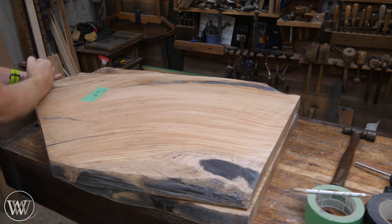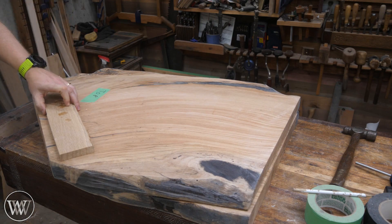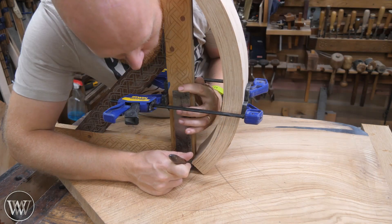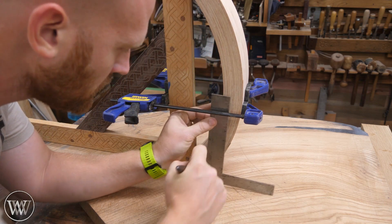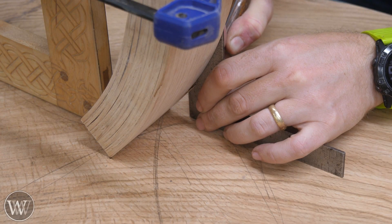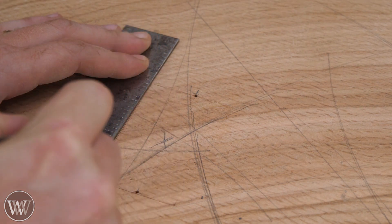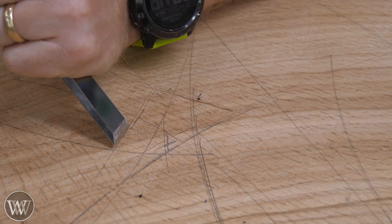We can come in and pound them down — putting a block on there and hitting them down will drive them in really nicely. Then we can pull out the nails and we have spots on the boards that match identically from top to bottom. Next I want to bring in one of the arches and clamp it up to a square so I know it'll be perfectly vertical and the top corner will match the bottom corner exactly, so that the force will be in line with it rather than making it want to twist. Then I bring in the square and transfer marks down to where this needs to be recessed, square off all of those marks, and now I have a rectangle on the surface with two dots on either end where the lowest point needs to be chiseled down to.